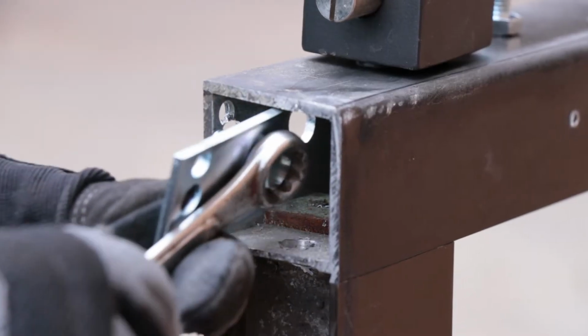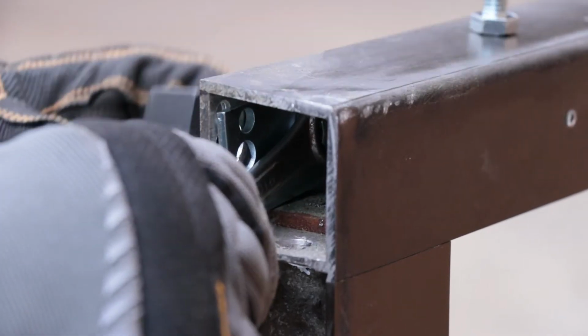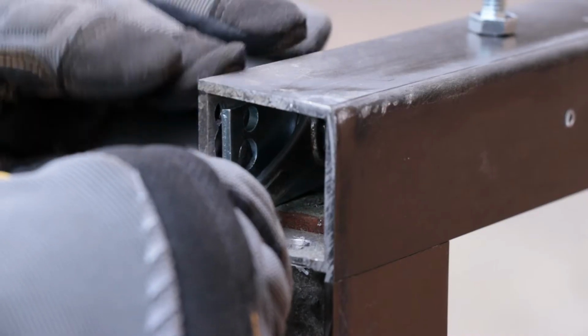With your new holes drilled, you can install the new top pivot on the door using the backplate and 2 of the hex bolts. You will need the 1/2 inch wrench to install these larger size hex bolts.